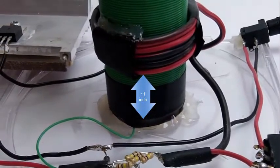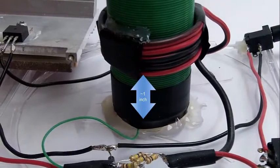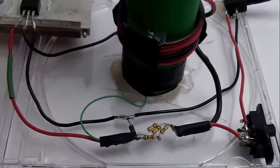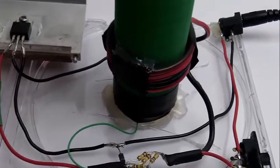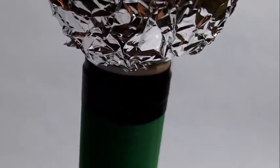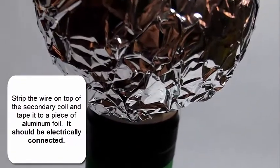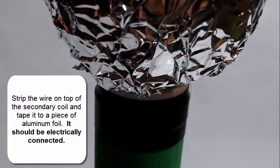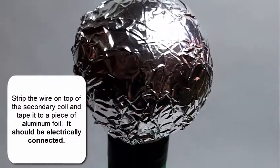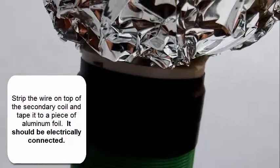What you can do is experiment — raise it a little higher or lower. You can also make the coil larger in diameter, but you'll need something to support it. I'm using a jewel case for the base. I attached the secondary coil to the base with a glue gun. On top, take the end of the coil, strip the wire, and tape it to a piece of aluminum foil with scotch tape or masking tape. Wrap it around a foam ball, tennis ball, or something similar, and glue gun it to the top of the PVC pipe.